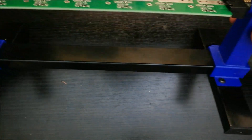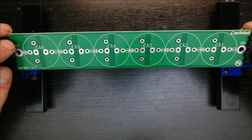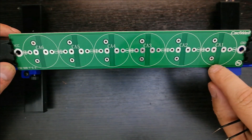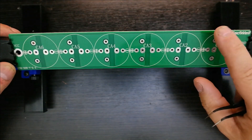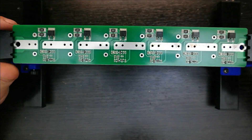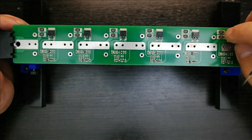I have it mounted in this nice little holding jig so we can work on it. If you flip it over, you'll see this side is VCC and this side is ground. We're going to be cutting right here eventually to get rid of the sixth cell, and this will end up becoming the negative right here. We'll have to uncover some of the solder mask.